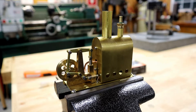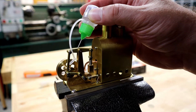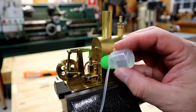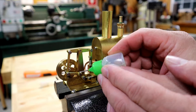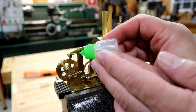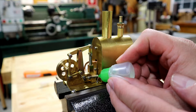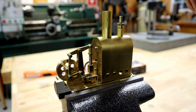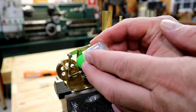One of the first things I'm going to do, since I haven't run it in a while, is just oil it up a little at a few points. Just give it some oil. With steam, you have to be careful to keep everything lubricated. So I'm going to oil all the joints I can — including the valve and over here, the crankshaft.